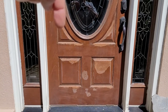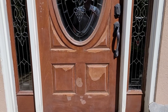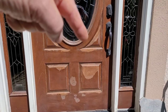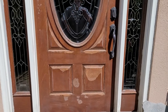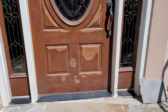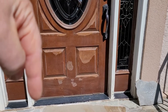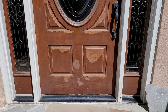I've already tried spraying this with an outdoor urethane but it doesn't look good - it doesn't actually match up with the rest of the wood. So we're gonna have to take the old finish off to see how it does. What we're going to do is just do the bottom of this door here first, just to make sure we know what we're doing. We'll spray this bottom part with our stripper and then try to take that off.